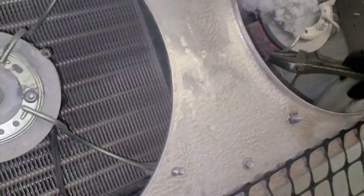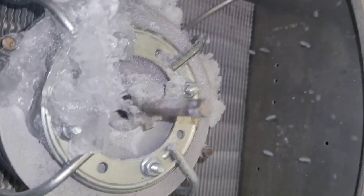Alright, number five. Looks like that one works too. So I'm thinking this is the only one that's bad. Looks like the drain's plugged also — that would explain that. It goes into defrost and it doesn't drain, so it overflows and then it makes ice.